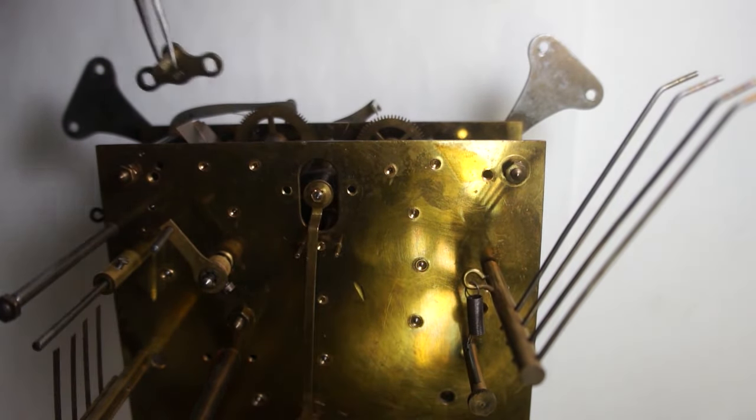And on the corners, these splines that were originally put in there, they didn't really give a whole lot of surface of the wood after the saw blade was cut in there. And this piece of wood here is just paper thin. And you can see where it has broke out. Here's part of the original wood that has been broke out here. I suppose their saw blade was a little too thick, because they just didn't leave enough material there to be structurally sound. And so after they put their spline in there to hold it there, they put these little cut-off needles in here to hold it. So I'm kind of thinking that these pins and needles used to hold this together are original.